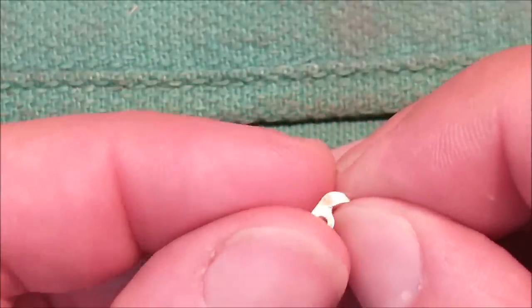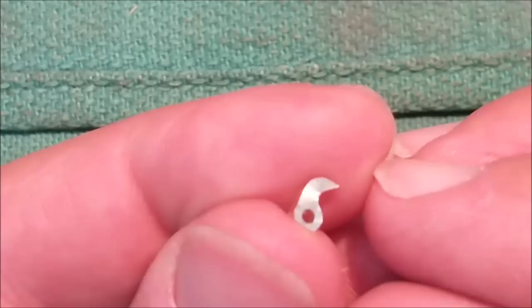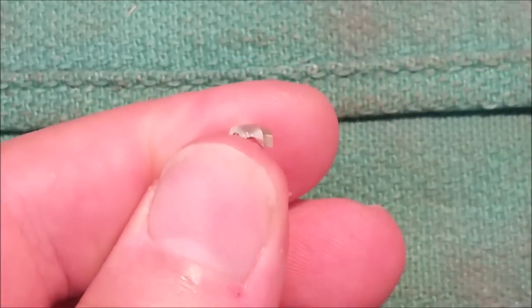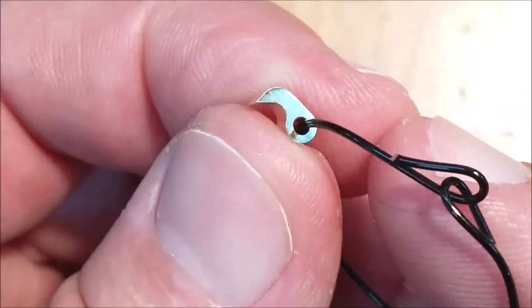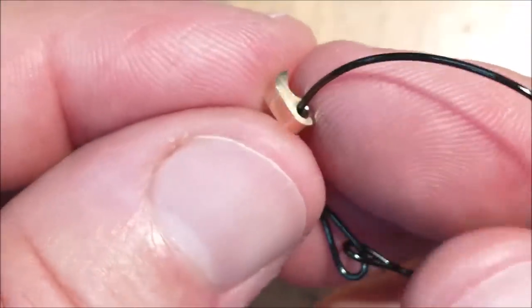I will take and put this back across the 400 emery on the bandsaw table, nice and flat. Polish it up, see if I can deburr it. Give you a final look when it's done, but how's that for small? Okay, clean it up. After a couple of light passes on some 400 emery and back to the cardboard with the metal polish on it, this is what I have.